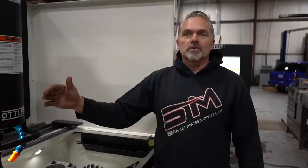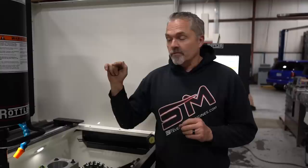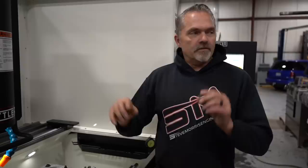Because here, it's brand new, it just set, so we would always start it out by taking some material out and then measuring it to make sure that, okay, now it knows exactly where it's at. And we know that it's very accurate. If we tell it to take out 5/1000ths, it'll take out 5/1000ths. But it needs to have that start hone in order to know where zero actually is. So that's what we're actually doing here.